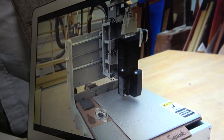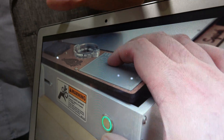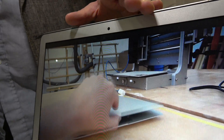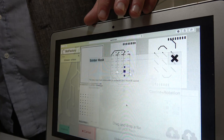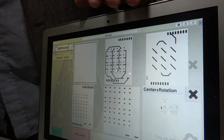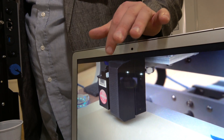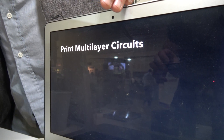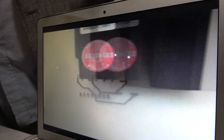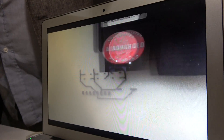The starting process goes like this — this is Squink, our first product. It consists of three different heads on a heat bed with a full gantry. You turn on the machine, pop open your computer, and upload your Gerber files — your drill files, your Gerber files, and your paste files. The first step is printing conductive nanoparticle silver. Heat changes the material into pure silver, and that forms the interconnects.